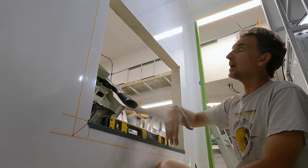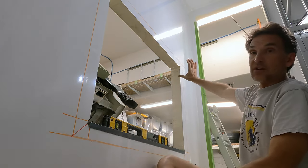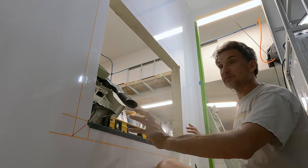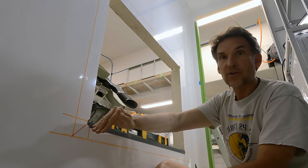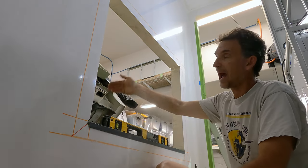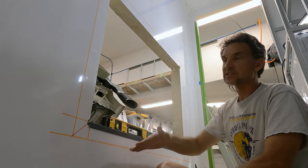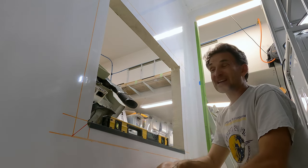Once I get that capped on, then I go ahead and put my bottom angle on and my sides, and then of course my top cap from the outside. And then we'll effectively just repeat the same thing from the bottom, the sides, and the top, doing 45 degree mitered corners, because that'll create a nice smooth transition for both my indoor cabin seal and my outdoor cab seal between the two. So it'll be nice and smooth for whatever seal is going to rub along that there. And so that's my easiest way to do it.